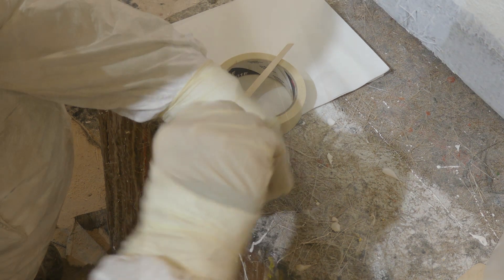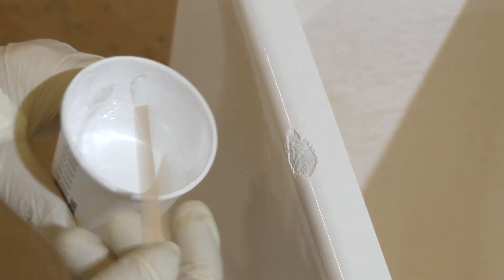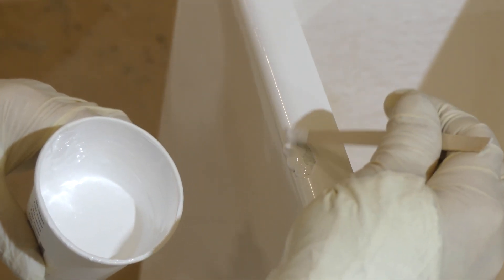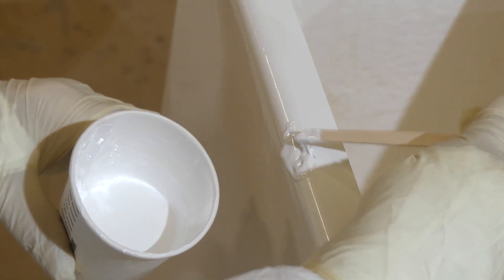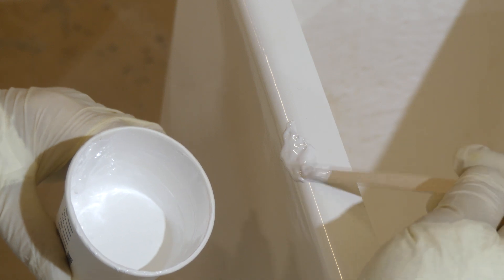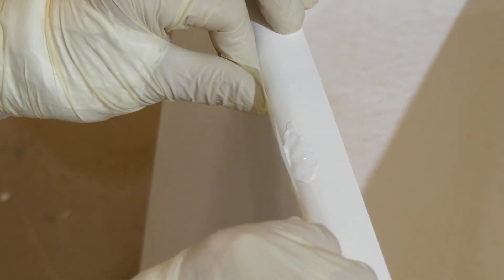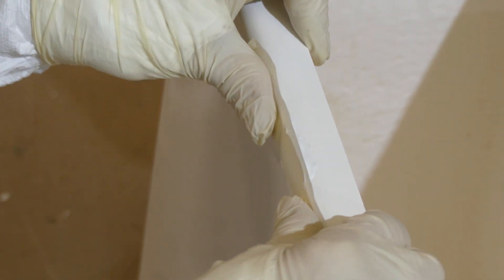With the area to be patched dry and clean, you apply the gel coat in small quantities and build it up. You don't drop great big lumps on — that's when you get air bubbles. Apply it slowly with the wooden spatula, which gives you a very small surface to apply with, and keep building it up. Once built up, put your masking tape on coming from the bottom, fold it over — the masking tape creates straight lines along the edges and holds it in place.